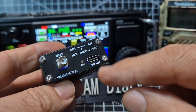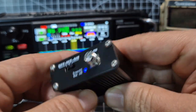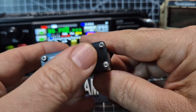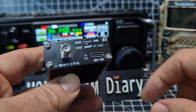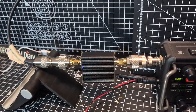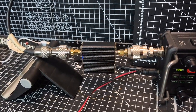It has a small battery in there and it literally lasts for ages. You've got your out, and if you look here, RF in. So effectively, you'll connect your VHF antenna here, and then the other end, in any way you'd like, you connect that to the BNC on your X6-200. Just get yourself a little SMA flexi cable to SO239, and then you'll be able to do it.